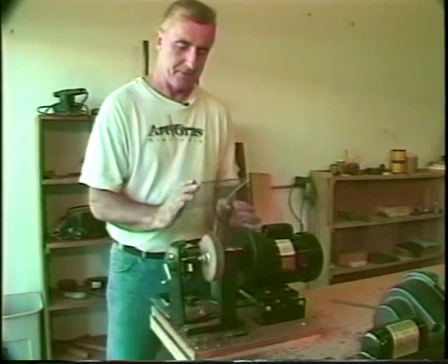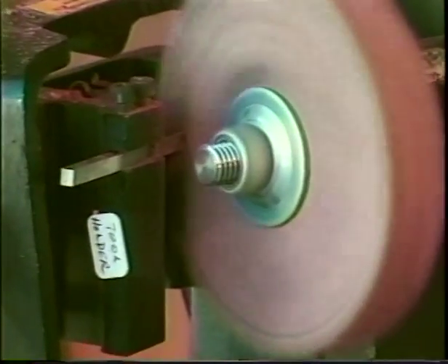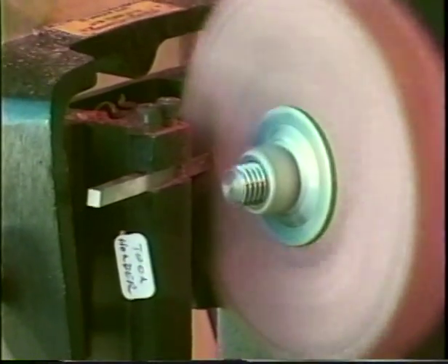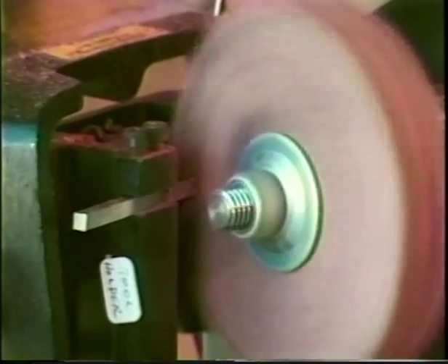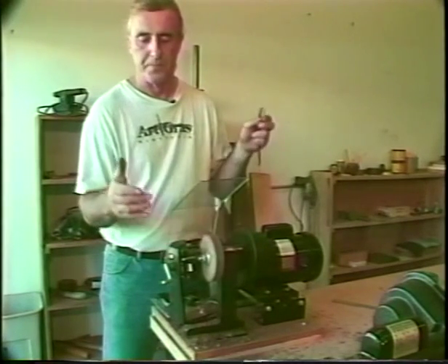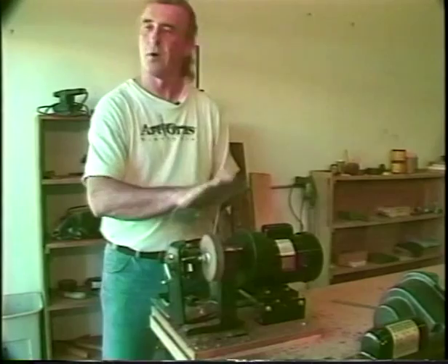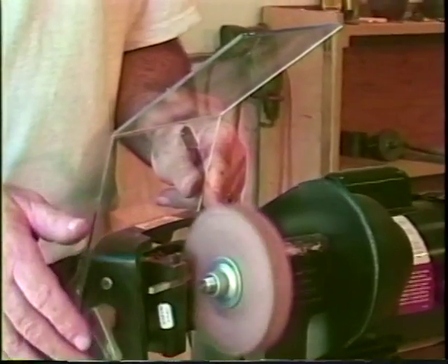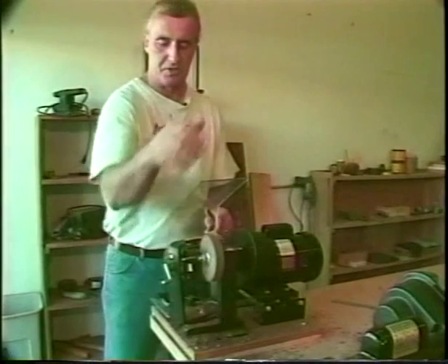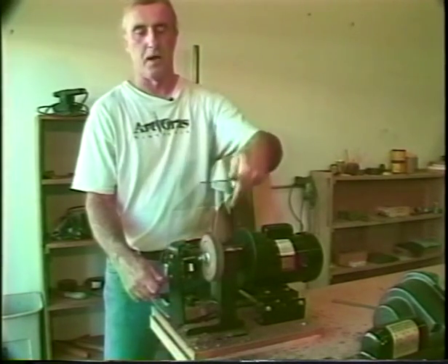This ringmaster is one fantastic instrument and it's extremely safe. I started my fourteen-year-old boy doing this when he was eight years old. If there's any cause for caution, it's at this first stage where you've got a new piece of stock in octagonal shape and you're cutting that first section off. Sometimes if there's a check in the wood or if you're cutting too close to the edge where the stock is thin, it can break on you. That's why it's nice to have this plexiglass shield. If you want to be extra careful, you could use safety goggles. One thing you want to be careful of is not to have people standing directly opposite you when you do this, because there is a chance when you finish this cut that a piece can fly off.